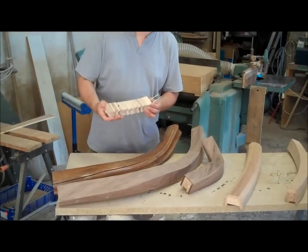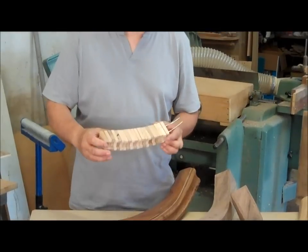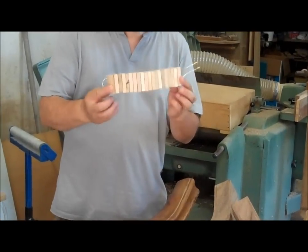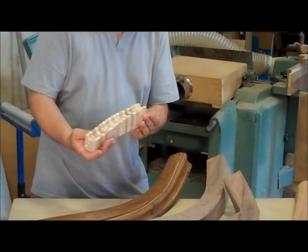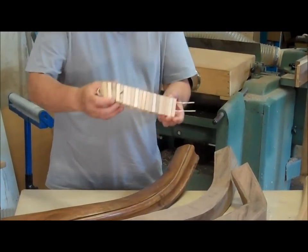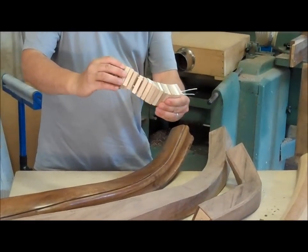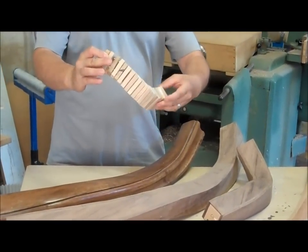This is a technique which I use for irregular shapes — irregular shaped handrails which have to be built following a metallic rail. The actual heart of the rail is built by putting these separate pieces onto aluminium wires, and this gives me a little snaky shape which I glue onto the metallic rail to get the exact shape of the hand line.